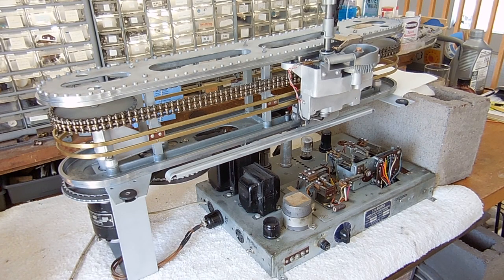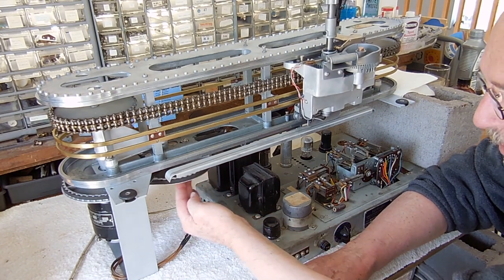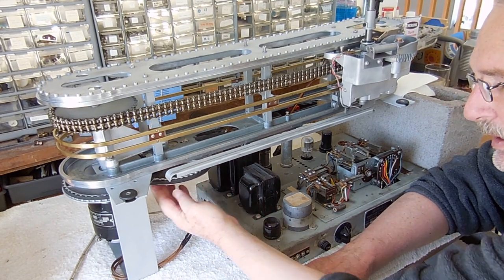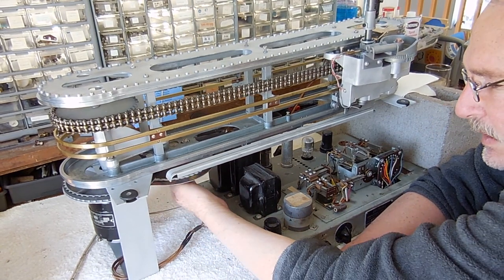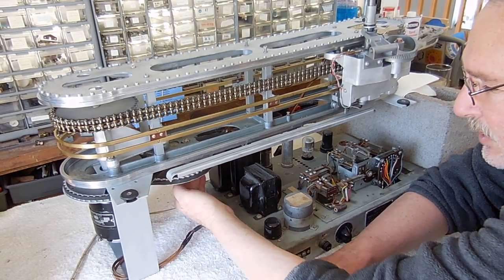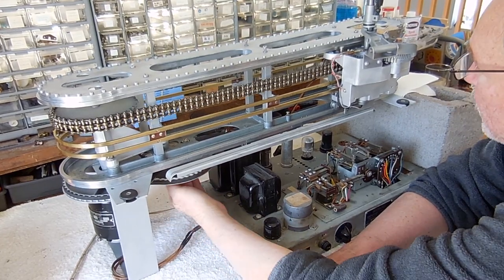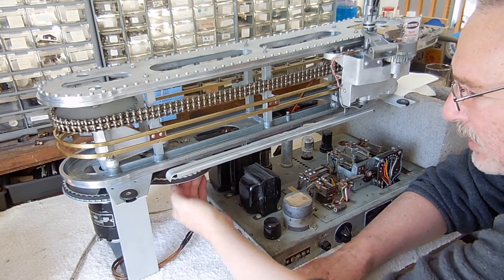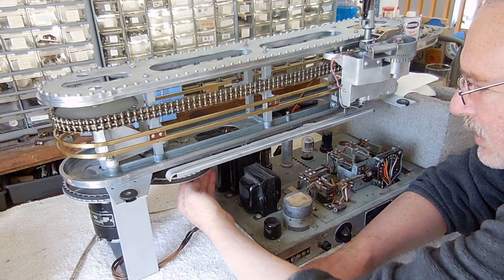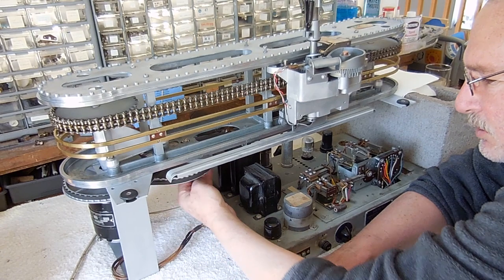One of my favorite pieces of advice is when you buy a new game, whether the previous owner told you it worked or not, don't turn it on. Make it go through its motions by turning the pulley at the bottom. You can see the bear carriage at the upper right. As I turn the pulley, the bear rises up, turns around and comes towards the left part of the picture. By doing this you make sure that there's nothing jammed.